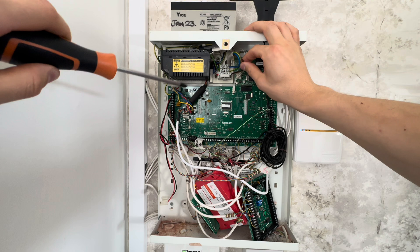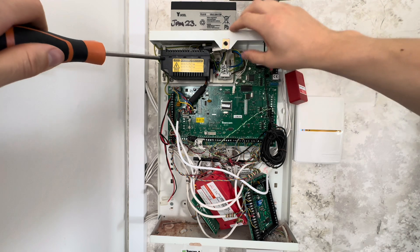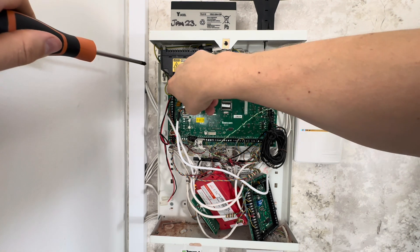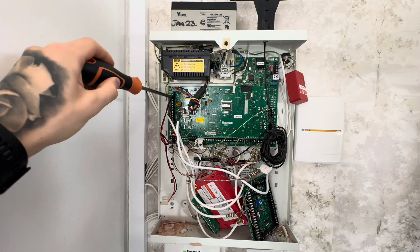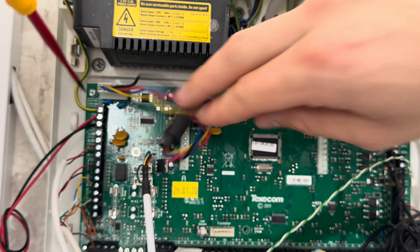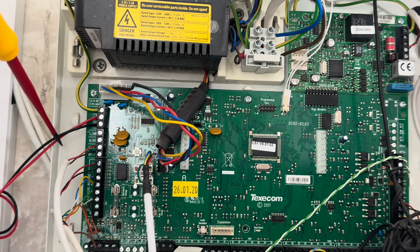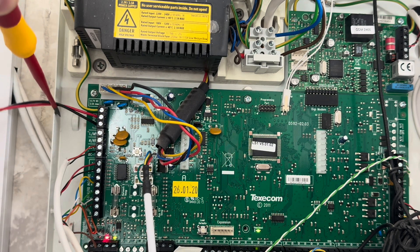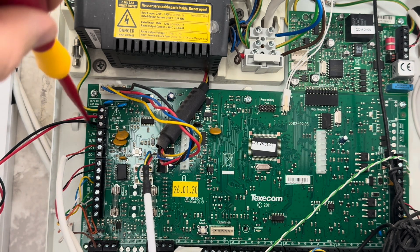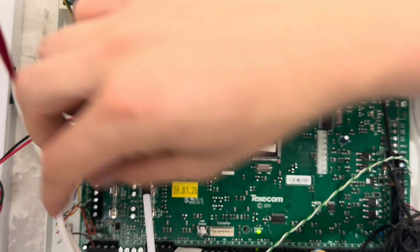In the top, coming in here, you have your alarm flex — your mains power coming from a fuse spur down there, which gives us our mains power. From there it goes through our transformer, which applies power to the panel and plugs onto the top just there. We also have our earth connection up on the left-hand side. Here you have your battery terminals — the battery leads that go onto the backup battery. Then coming under here you've got DC positive and DC negative, providing DC power for your communication system, which in my case is a dual comm.